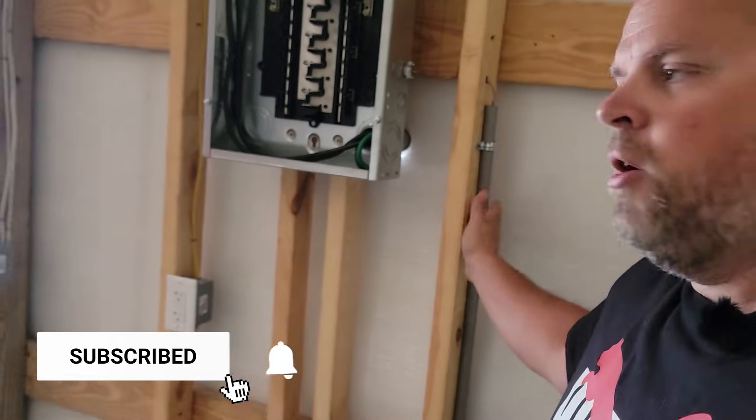I wanted to follow up with you guys and let you know the mistakes that I made, because it's not fair to say that everybody always passes their inspection, especially on electrical inspections. If you've ever been working in a different type of structure, like commercial, I wouldn't pay attention to this video. But if you have an agriculture building or a pole barn and you're going to have an inspection, make sure you're using the correct wire. It doesn't have to be MC - you can put it in conduit - but I find that flexible MC wire is a lot easier to work with and almost as cheap.